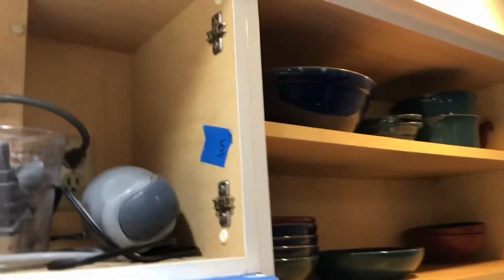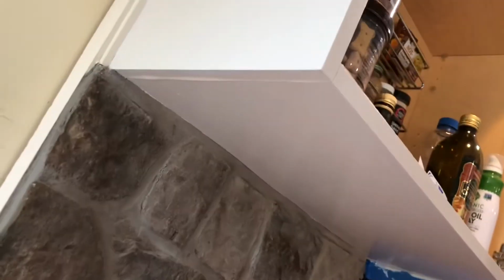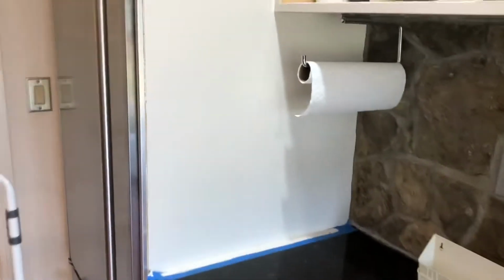But as you can see, on my second visit here, I had already painted all of these surfaces and patched up a little bit too. I did the outer shell of things. I do underneath. I had a totally different color on the sides. This is all done with primer first. This BIN shellac-based primer first, and then I rolled using a foam roller. I rolled the rest. There's a dog in the background trying to scratch through the door. Anyway, there's always a little bit more patching to do on the last day.